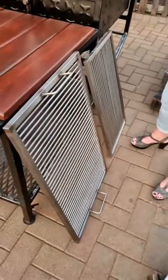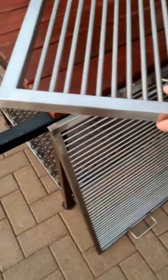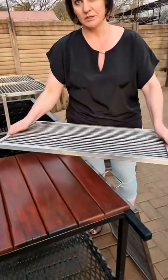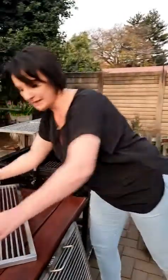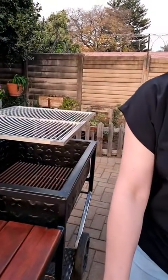A lot of people ask us if we do custom grids and also standard braai grids. As you can see, we do all kinds — we do custom work. This one is more of our standard sizes that you get in a normal built-in braai as well. It's still the free-floating system, as you can see, with solid stainless steel round bar at 8mm and the square tube that it goes into. It expands into the square tube as the heat feeds to it, and when it cools down it contracts back so it doesn't warp.